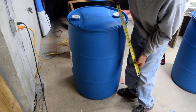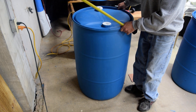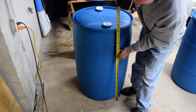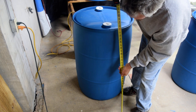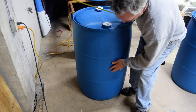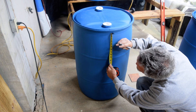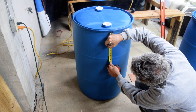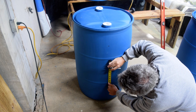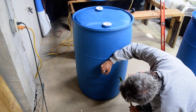I want to put the seam towards me because I always start at the seam. There's my seam — you can see there's a seam right down here. I start with that and measure down. I want to find the center point between these rims — see these humps? I don't want to hit those as the holes will be difficult. I come down here and it's 10 inches, so 5 inches would be my center point. That one, and that one, and that one — and this one is 11 inches, so 5 and a half inches is the center. I'm putting it right from the seam.